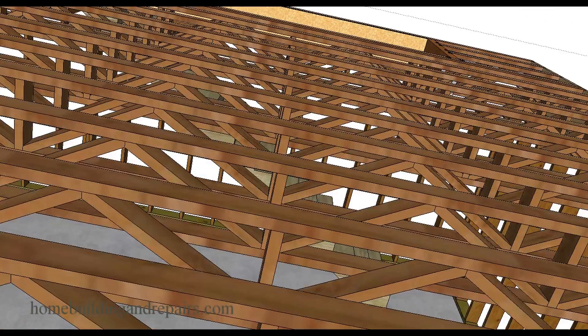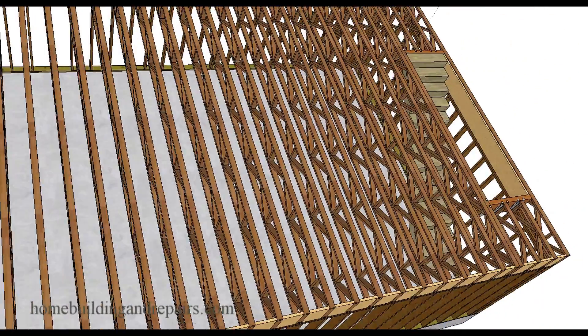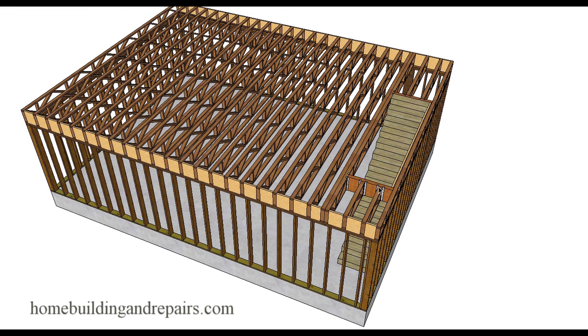Here's another view. No wall here — if you had a wall here then you could probably get away with a single floor truss, and you could probably use a conventional beam here without needing a floor truss for something like that. Stairways that run parallel to the joist will require a little less effort, and you'd be able to use more of the conventional standard-size joist that you could purchase from a lumber yard.